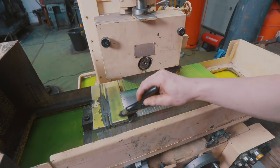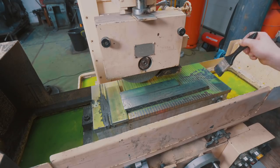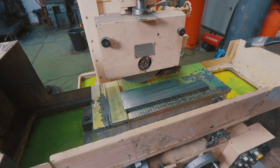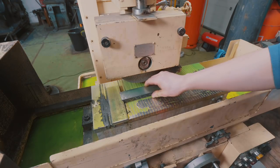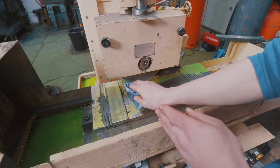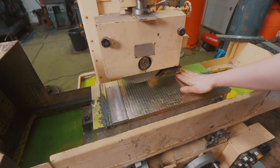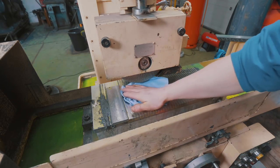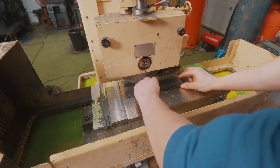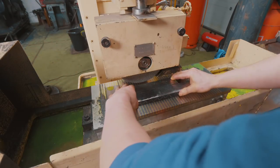That actually did not take too much time. I was pleased with the amount of stock removal we were able to get — I thought it would take a lot more time, and milling might indeed be more efficient. This is a 60 grit wheel; imagine with a 46 grit wheel. And when you convert a surface grinder to belts, you're able to take even heavier cuts, so this could really be an unbelievably wonderful tool for these Damascus projects. Even though we're just roughing it out, we've got a pretty good surface finish. Now we're going to clean off the chuck, make sure there's nothing underneath it or on the work pieces themselves, and both pieces are getting flipped over to do the same thing on the other side.